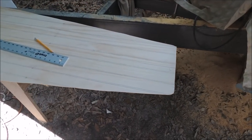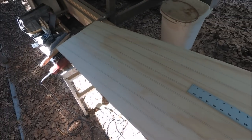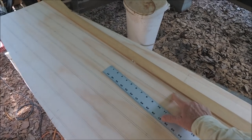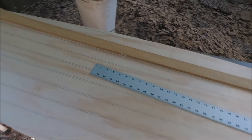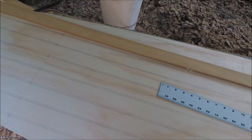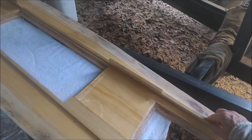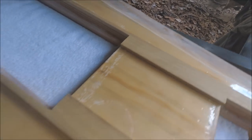Here's the three-quarter plywood we're going to use for the cabin sole. It's already been cut and shaped to fit, and I've drawn the lines for the Iroko strips that are going to be placed on top of it later so we can get the spacing right and know where to cut the doors. We don't want a seam right on the edge of the door, because we're going to make this like a teak deck with black polysulfide sealant between each strip. Before fiberglassing down the plywood, I laid out where all the strips will go and cut out for the doors, as it's much easier to do that now than later.